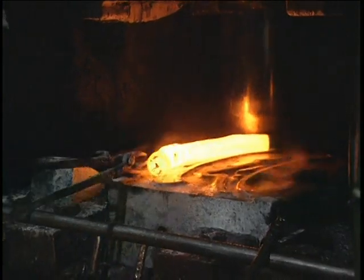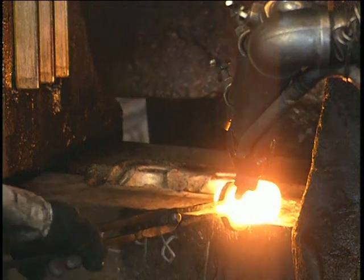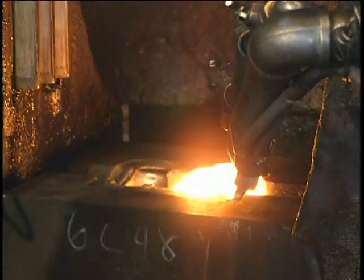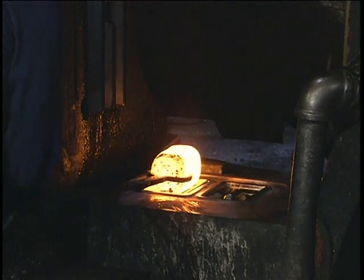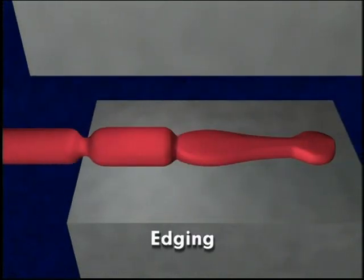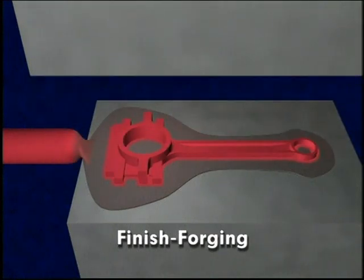Impression die forging, also called closed die forging, is the deformation of metal at forging temperature within one or more die impressions or cavities. It is performed both in presses and hammers. Workpieces may be round or rectangular in cross section or flat discs, and the dies are sometimes integrally heated to minimize chilling and cooling of the workpiece. For simple shapes, impression die forging can be performed in a single press stroke. More often, however, several strokes of different force are used with dies having several impressions for sequential preforming and finish forging operations. Preforming operations may include edging to increase the workpiece cross section, blocking to refine the shape for finish forging, and finish forging to complete the shape.